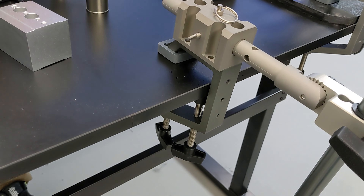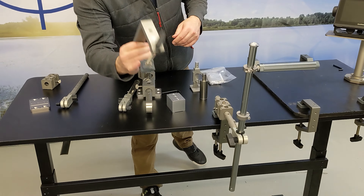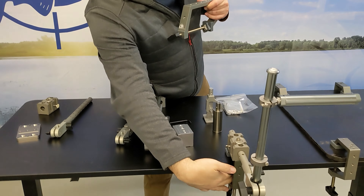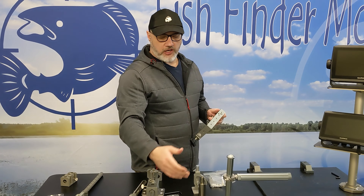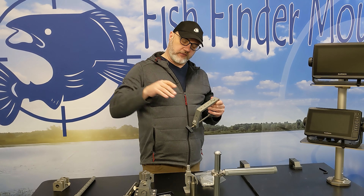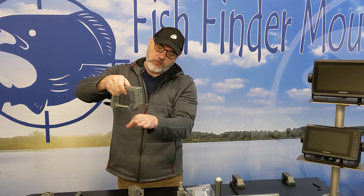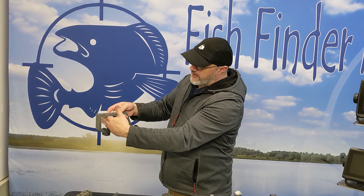I had this on a clamp for display. Notice the clamp — these are gunwale clamps and they're phenomenal. You can make them into dual jaws. This is a dual jaw version; if the camera looks underneath you can see it's a dual jaw with a secondary jaw that can actually correct the pitch of the clamp. You can mount the receiver blocks on the end or the top. Typically on a boat your gunwale edge rises up from the keel, and the clamp sits right there — that's why we call them gunwale clamps.